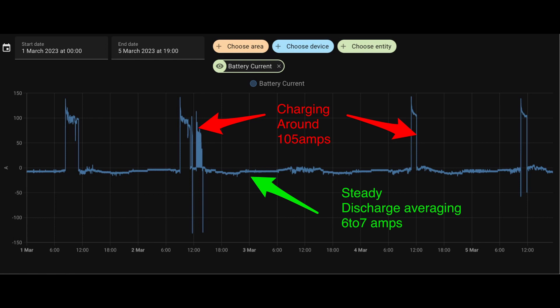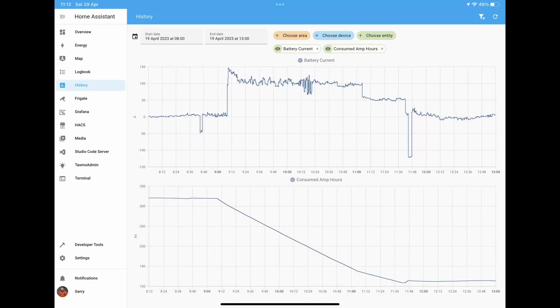Moving on to generating from the engine: this slide shows a number of days where we've run for a few hours in the morning and we see somewhere in the region of 100 to 105 amps — made up of the charge from the Victron unit running off the travel power and the charge from our 110-amp alternator, which really runs at about 50 to 60 amps once it's up to temperature. A typical morning cruise of about a couple of hours sees the battery charge immediately jump to around 100 amps, and we can see that we've replenished the batteries to the tune of about 200 amp-hours — plenty to keep us going on normal days.